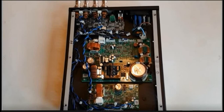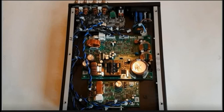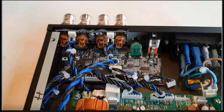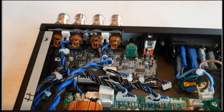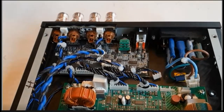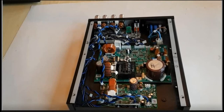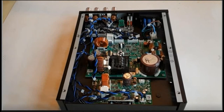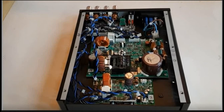Then you have to remove all the screws that secure the boards to the chassis. You have three boards located on the bottom of the chassis, and a smaller fourth board secured to the rear of the binding posts — held by a small screw and four nuts. Also don't forget a small screw on the rear of the amplifier, located directly to the left of the gain setting. With the screws removed, it's very easy to remove all four boards at once. If you have two amplifiers, only dismantle one so you can use the second one for reference when assembling.